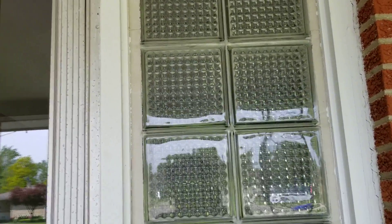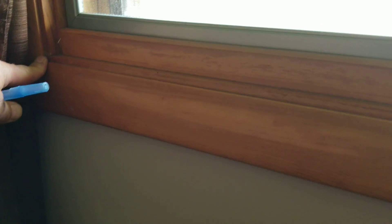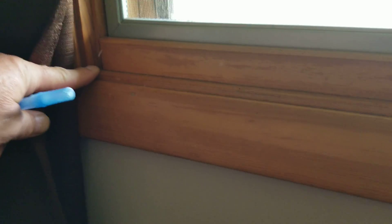Here's one of the front bedroom windows where you can see this wood trim right here. The trim molding is in relatively good shape and sometimes we can get that off and put it back on without breaking it, but sometimes you can't because of the age. If the primary window is being done that trim has to get removed, reinstalled, or replaced. If a replacement window goes in, the replacement window stops right here — you just take the sash out and the new window lays right in this opening.